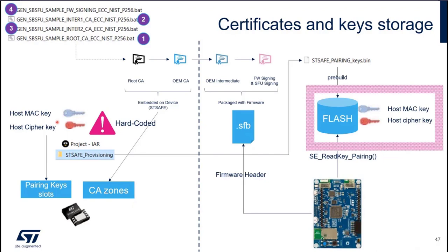The OSMAC key and OS Cipher key go to the pairing key slot of the STSAFE. All this is implemented thanks to a project called STSAFE provisioning. This project uses hard-coded keys, so for a real deployment in the field you need to diversify these keys. The project is able to diversify the keys, but there is a static .bin file — STSAFE pairing keys.bin — used by SBSFU to flash these keys into the secure engine firewall, which makes diversification less straightforward. The intermediate certificate and the LEAF certificate are packaged with the firmware in a bundle called the .sfb file, all done by the SBSFU build system.